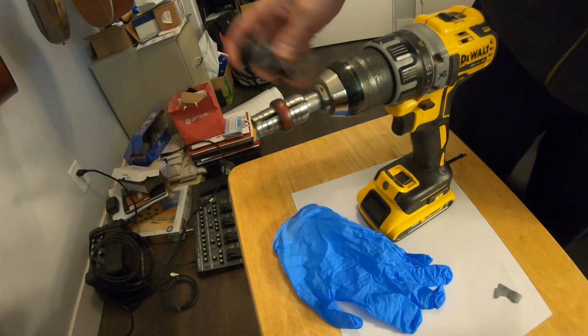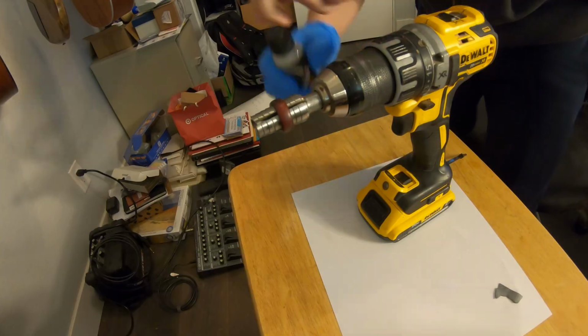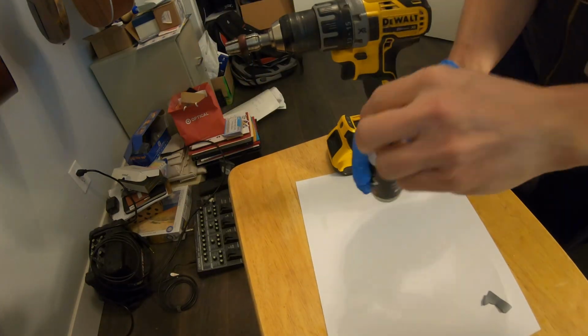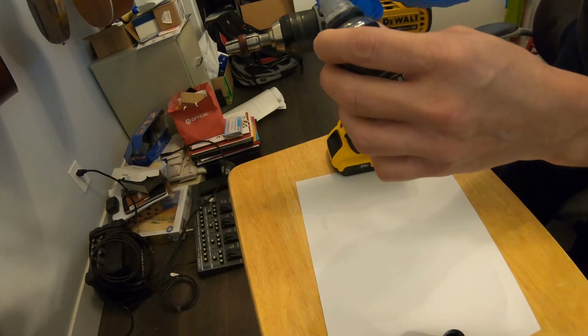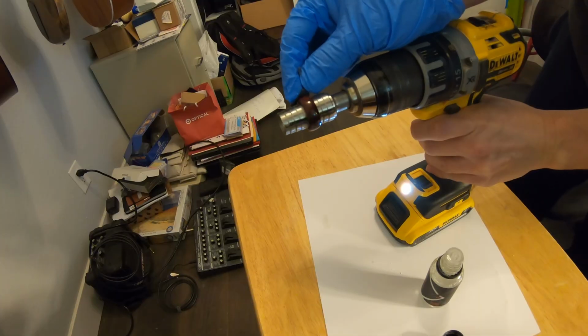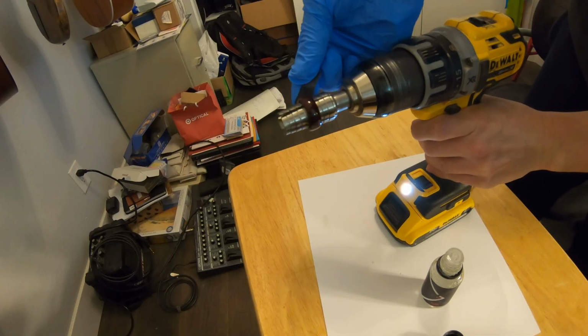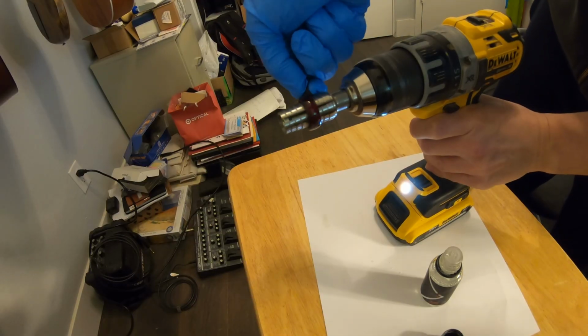The final step in the process is something I've started doing as a result of the abuse my friend puts his rings through. That final step is applying Blacktail Studios N3 Nano Coat finish. I do this in an attempt to make the finish of the ring more waterproof. The Nano Coat finish was made for larger items like gigantic tables, so the process is slightly different but essentially the same. The first thing to do is shake and apply the hard coat.